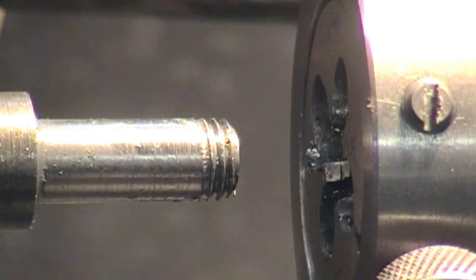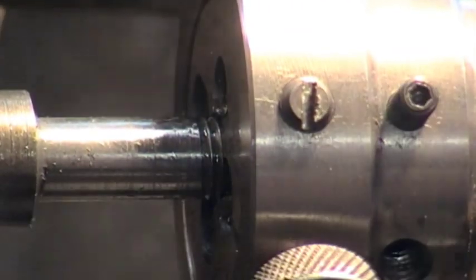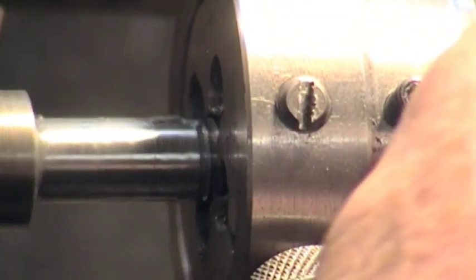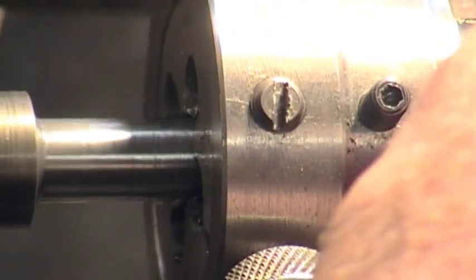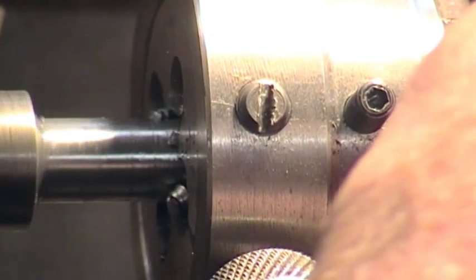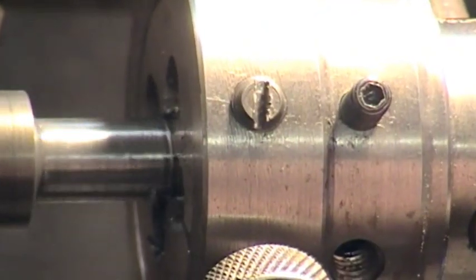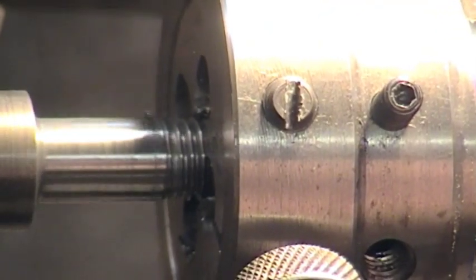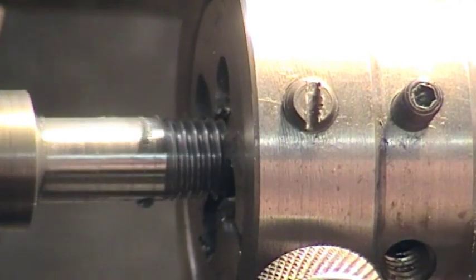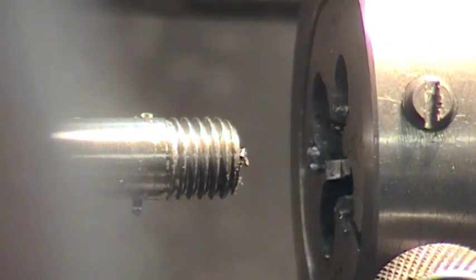I've mentioned the fact that this is really very often just to start a thread for two or three turns, but there's plenty of depth in this holder. So if I come back here again with light pressure to the left - threads re-engaged, now we're biting. I'll take another whole turn, two turns, three turns and back off. See, that's now coming off the thread on its own. There we are - I've got about five, six turns.